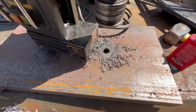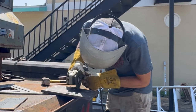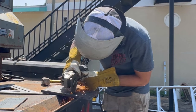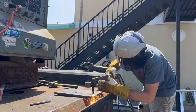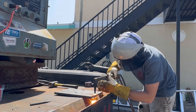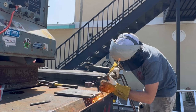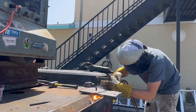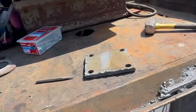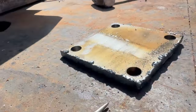We've got our holes all drilled out, nice and even. The next thing is to blow this out with a torch. I'm running my grinder over the mark because when you mark things with Sharpie on metal, the torch will make it disappear. This little trough made out of angle iron in the back of my bed is one of my favorite features — it keeps the slag from going everywhere and messing up a customer's floor. Especially on concrete, you don't want hot slag to pop up the customer's concrete. This is a pipeliner's bed originally. It's not perfect but it'll clean up really nice.